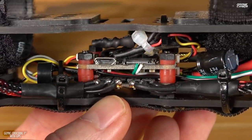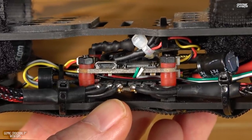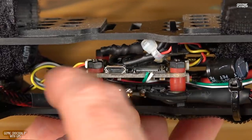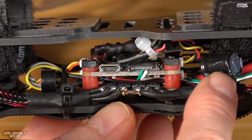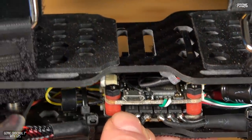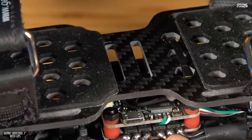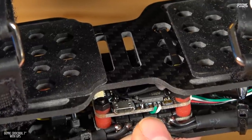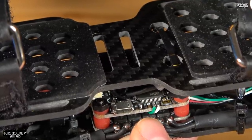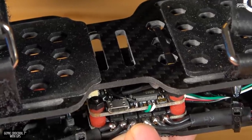Looking at the stack underneath here — I was really impressed. This is the GEPRC F4 SPAN with barometer on board. It does not have a magnetometer, but you're not going to really need it. You have a full-size beeper in here, which is great. You have a capacitor back here, which is great for cleaning up your video. You have a built-in LC filter, your USB port is here, and over here you have your boot button. You can update it to the latest Betaflight — the firmware that came on this board was from July 2018. In the GPS world in Betaflight you want to make sure you have the latest updates.